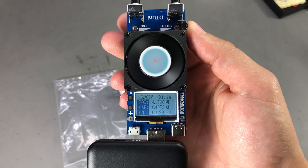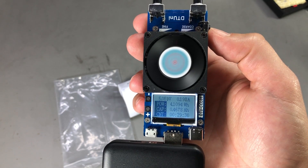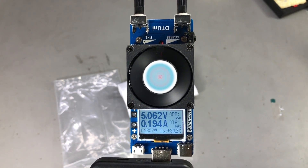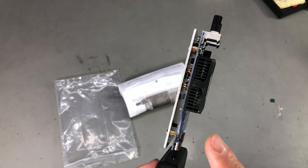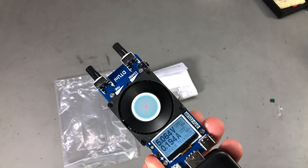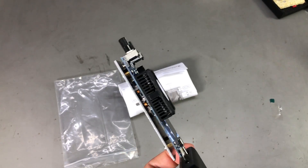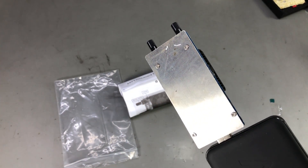You have a few different screens you can cycle through with a short press of the switch. You can also trigger protocols like Quick Charge 2.0 or 3.0, or adjust the protection thresholds for over-temperature and over-power protection. The resolution is 1mA and 1mV, though accuracy might not be great — I haven't checked yet. It has a built-in cooling fan and heat sink, always on. It somehow manages to keep stable at 50°C if you sink about 20W.